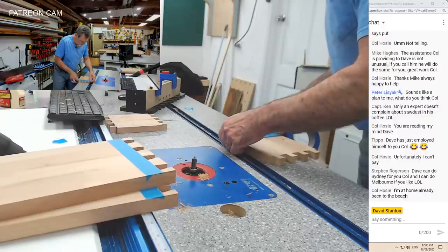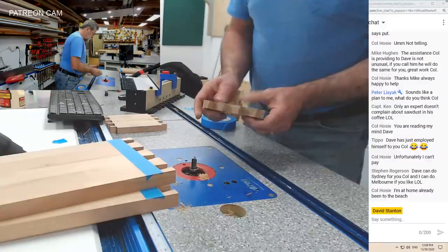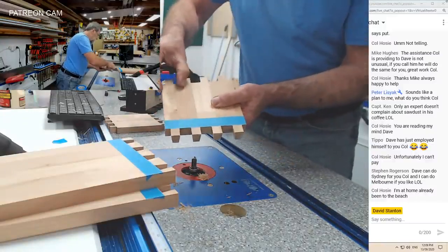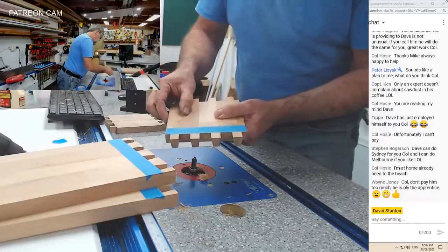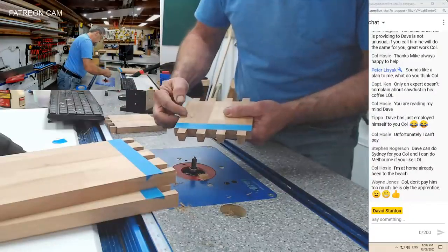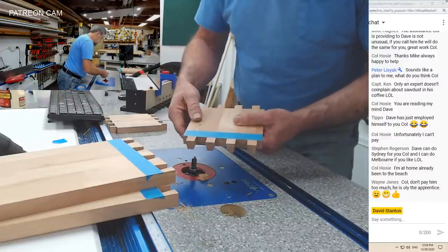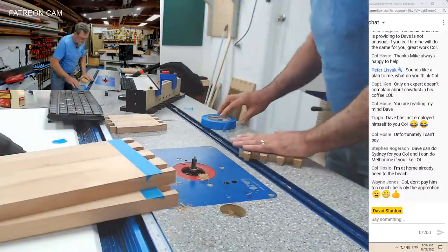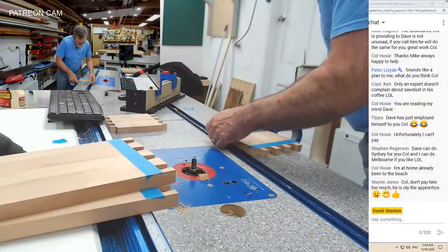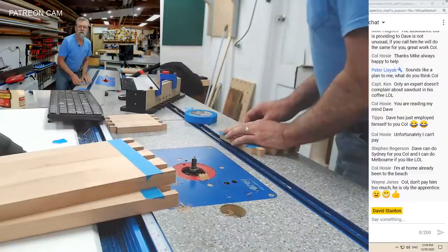And the reason they say to use a mitre joint is because they want you to create a rebate through here, or rabbit in the States, to slide the soundboard up inside. Now, I'm going to have to use a router and create that rebate inside the box when it's finished. But I wanted to do the joints because I just love learning a new way of doing stuff.